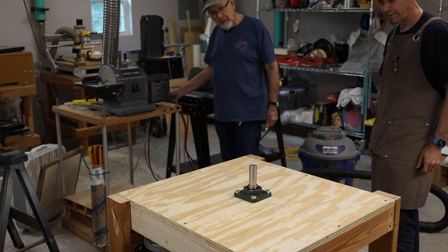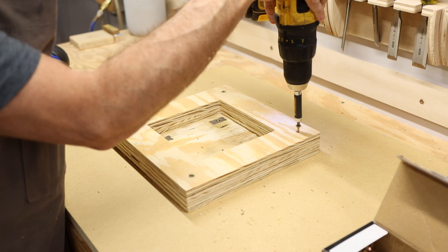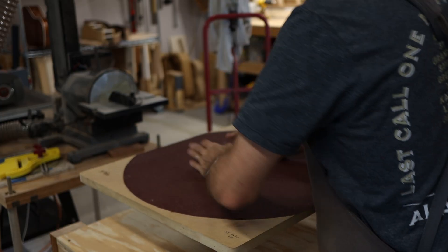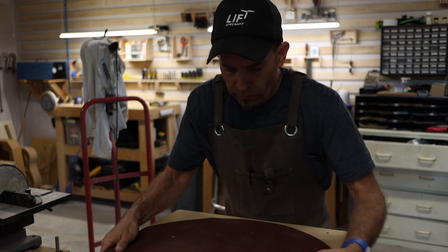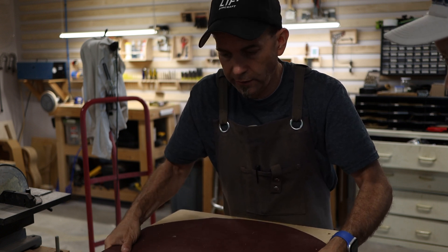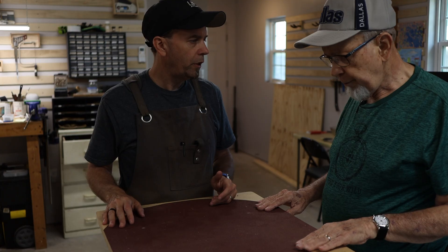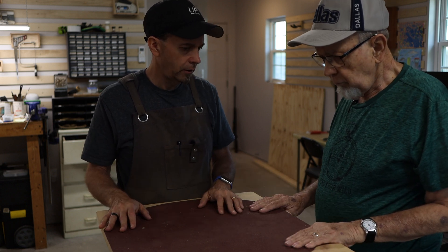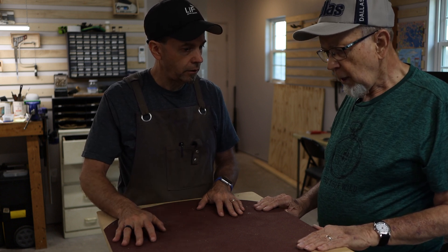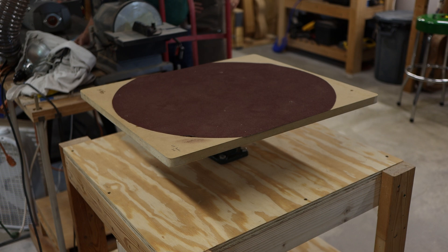Give her a shot. So when we lock this on, I can feel the magnets catch — I've got to pull to get it off. I am getting some magnetic pull. We could use stronger magnets. The magnets I have in here are 20–30 pound magnets, whereas I could put like a 70–80 pound magnet in there — but remember, you do have to get this off. Three, two, one — lift off.